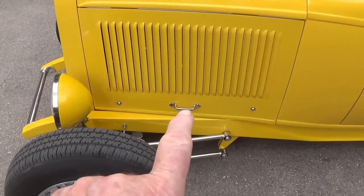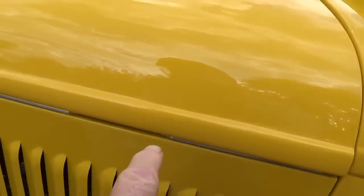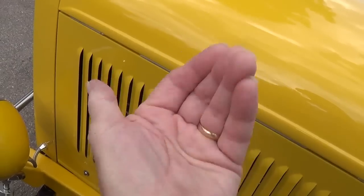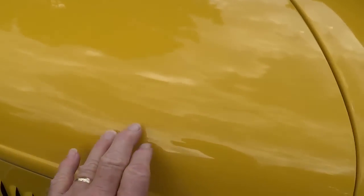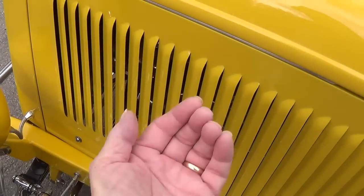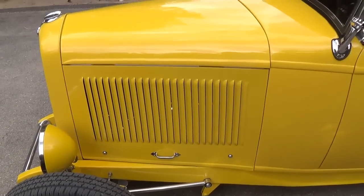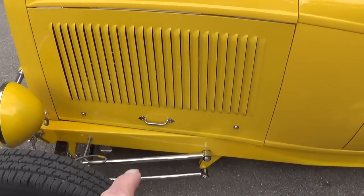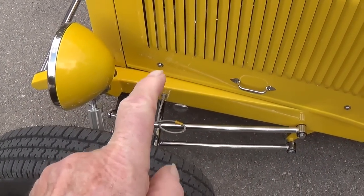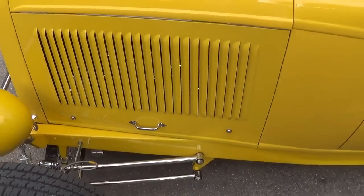Put in stainless steel handles. I had to come up with a way to mount these. And I'm not sure if you can see it, but there's an aluminum L-shaped shelf. It's a 90 degree aluminum shelf, and the hood then can rest down on the shelf, and then from underneath the hood sides go up with pins and are located into it. So it's very neat, really no exposed hinge. And instead of latches, I went with stainless steel bolts that go into a sort of subframe that I built in here so that the side panel is held very securely.